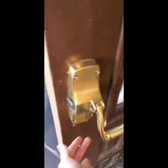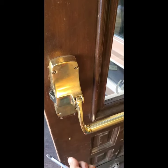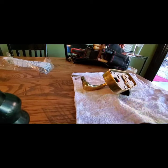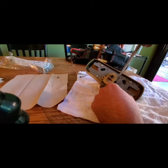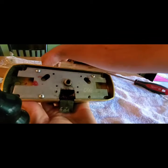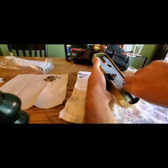Here we've got a panic bar and the spring is not retracting, or it's not extending the latch as it should. The diagnosis is a very, very weak spring. We tried everything we could to try and realign the panic bar system to see if there was an alignment issue. However, there was not an alignment issue — it was definitely a worn out spring issue.